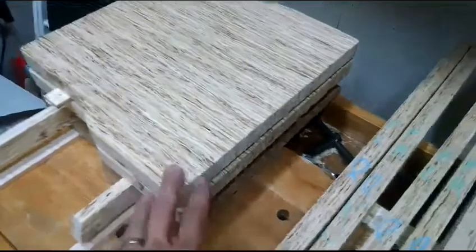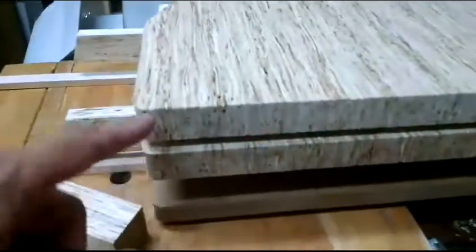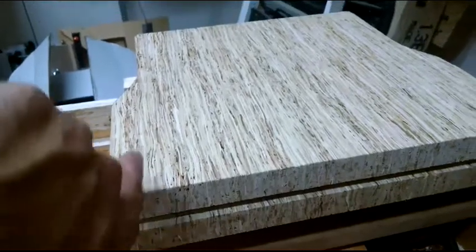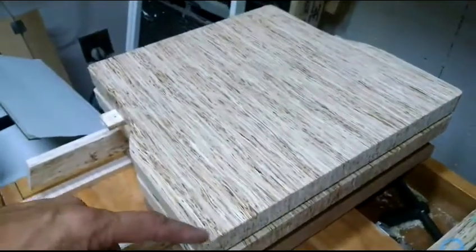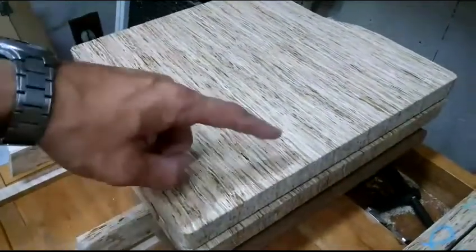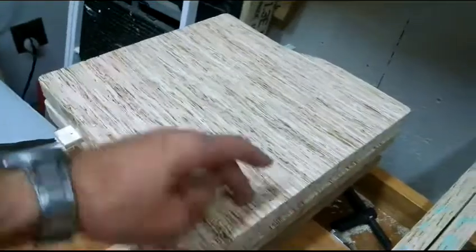The way I laminated the seats, for aesthetic purposes — these are a little difficult to tell in the end grain — but these are timber strands with the grain running vertically. I'm going to loosely call it grain. They're all laminated together, so both the factory glue lines and my glue lines run lengthwise from the front to the back.